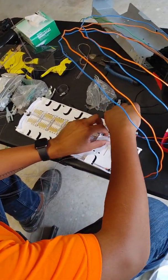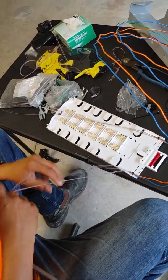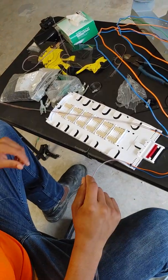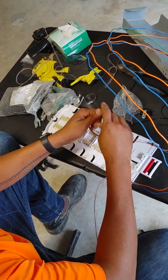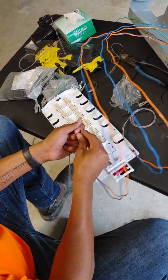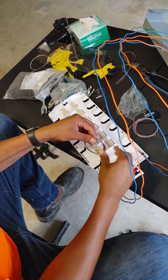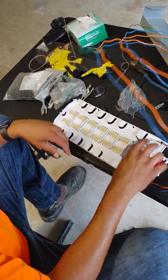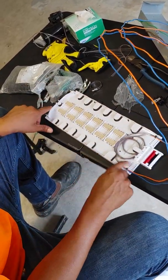Now I'm ready to go — I'm set and ready to splice. This can be anywhere. I'm going to have my shrink side on one side and all my splices on another side and we're good to go. After you splice it and wrap it back in, the splice will be covered in another video. Also, this is the correct way to roll those dead fibers. Now put the tray lid back on and always double check the sides to make sure there's nothing in the way.